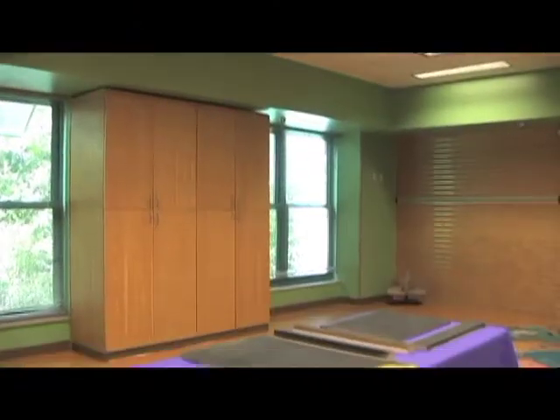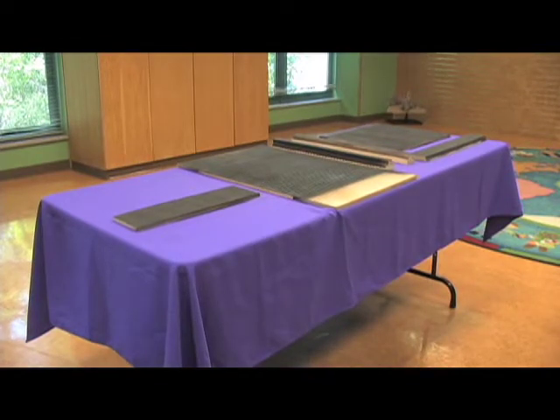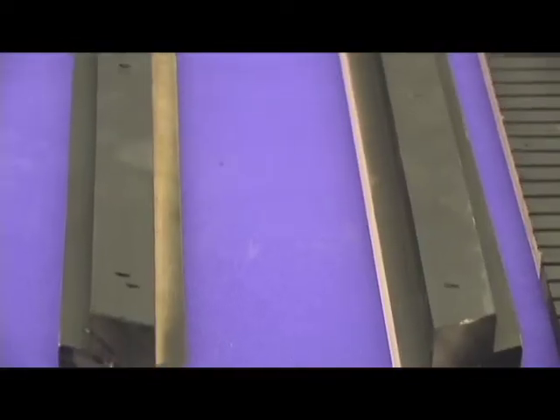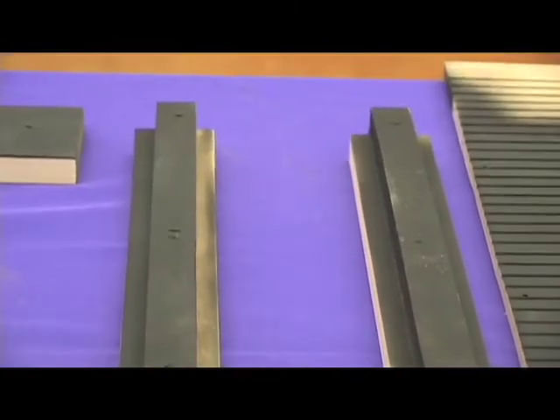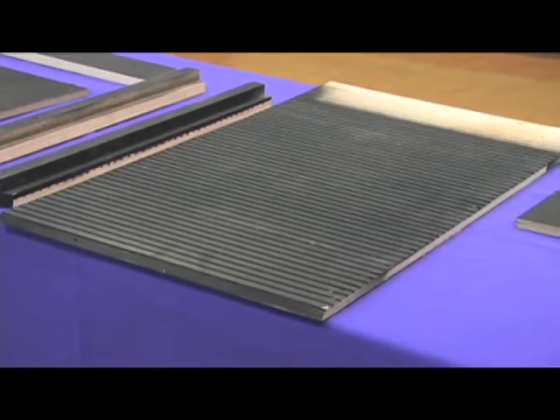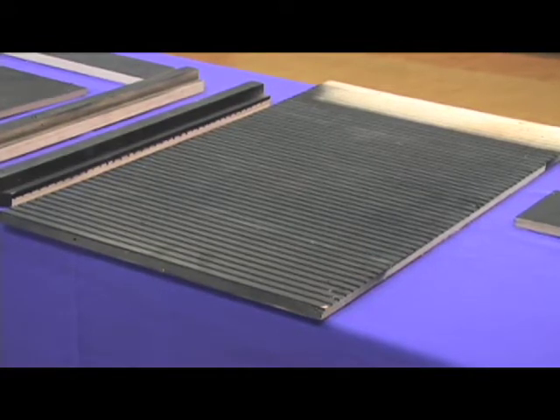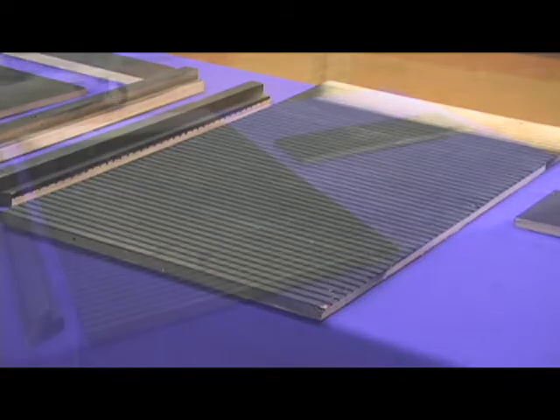Their construction is really simple, and pre-made kits can be found in stores, so you won't have to measure or saw pieces. If you choose to build one out of your own wood, though, make sure that the final product will be at least 14 inches wide and 2 feet tall. A box this size should be able to house a full 50 bat colony.